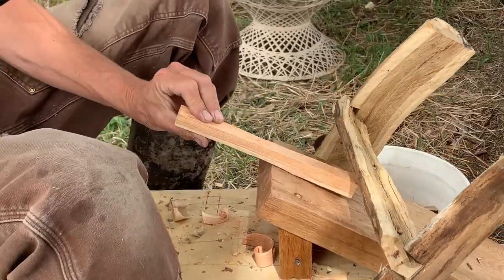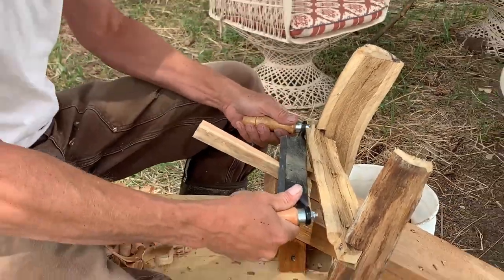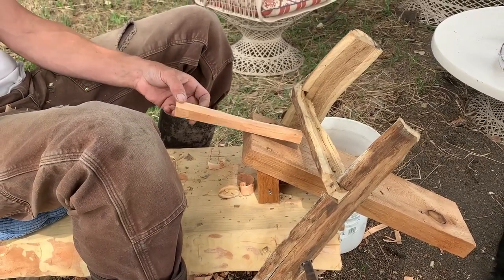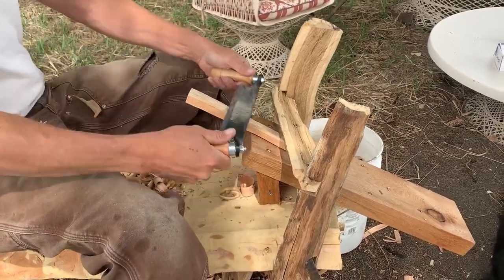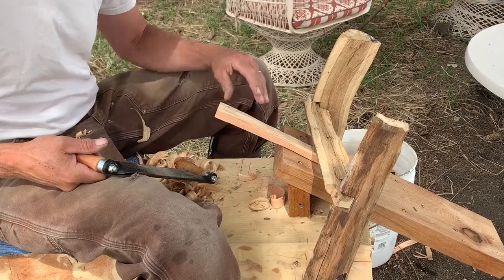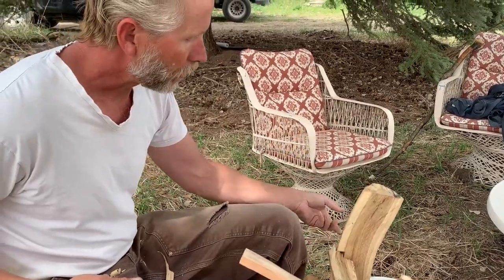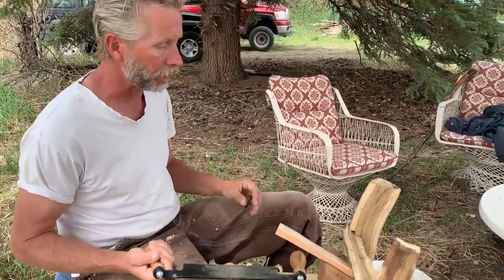The diameter of this peg is relatively crucial. If it's too small, it's not going to hold the joint securely. And if it's too large, we run the risk of splitting out the wood it's going into. The blanks are made of black locust wood, which is super hard and super heavy. The timber frame is made of Douglas fir, which is much softer. So if these are too large, when you go to drive them in, you're going to split out pieces of the softer wood because the black locust is not going to give against that timber frame.